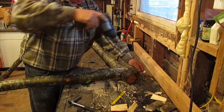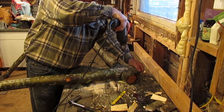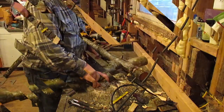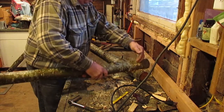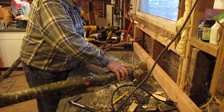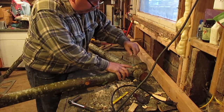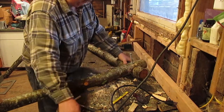Like I said, this is not the best — it's just better than nothing. Now we drill this hole with the two logs together so that the hole lines up. Now that you've got your notches cut and your holes drilled, it's time to put your piece of all-thread through. It's good, if you're using all-thread, to start your nut first, because when you drive this one through you're likely to booger up your starting threads, and you certainly don't want to do that and then try to get a nut on it.